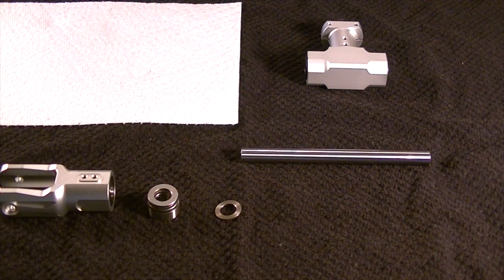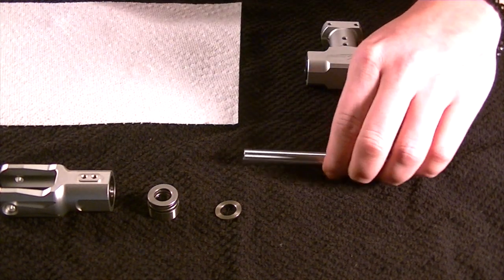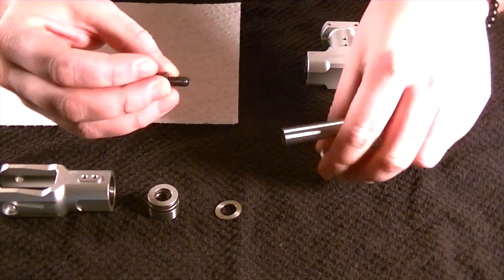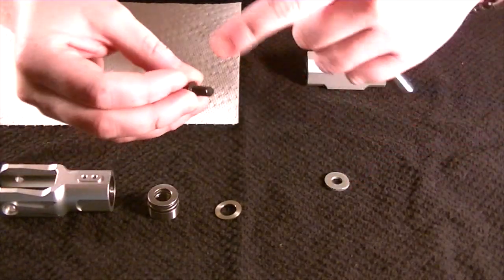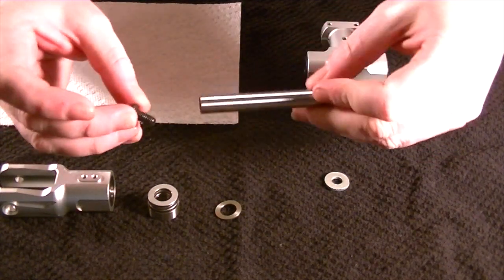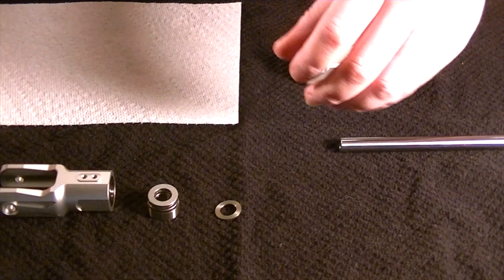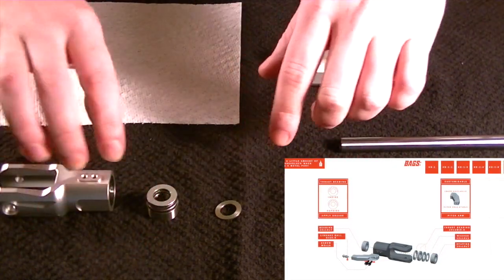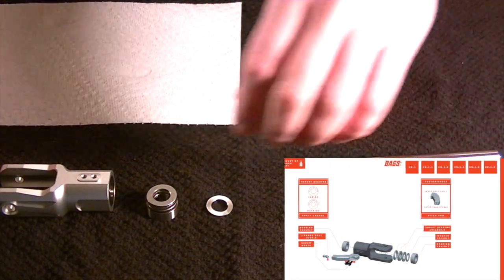I went ahead and got everything fully disassembled. Went through and cleaned everything — threads with rubbing alcohol. I do clean the inside of the spindle shaft. The trick I use is to take the bolt and submerge it in rubbing alcohol, thread it in and out repeatedly, take it out, clean the bolt, and do it again — about three times — just to make sure all the contact points are really clean with no grease. That way, the Loctite really adheres very well. The first step in the manual is the assembly of the thrust bearings, the main bearings inside, radial bearings, and the shim. Greasing is basically what we're looking at now.